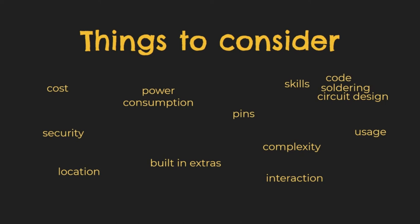Some of these boards have built-in extras as well. For example, the micro:bit has an accelerometer — that's why I can attach it to my circus friend and measure all the forces on him, because it has a three-axis accelerometer, like on your phone when you tilt it and the screen changes. There's also a compass so it can detect where it is in the Earth's magnetic field. There's a light sensor and a temperature sensor of sorts — it senses the temperature of the processor, so it's not a proper temperature sensor, but you can easily connect a proper one.